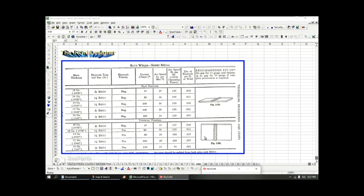But what it shows you basically is if you're welding in the flat position or in the vertical position, so you're going up, you see how they're pulling this way? So imagine your welding rod is going upward. You start at the bottom and you're piling on weld. And I think on this one, they're welding toward us. But you can look at the rod that they're using, the advanced 6011 rod. And if you're here in 1/8 inch diameter with advanced rod, then you're in these ranges from 16 gauge. You can even go all the way up to 10 gauge. And I'll let you guys just look at the amps on your own.